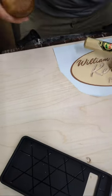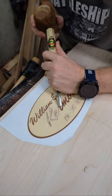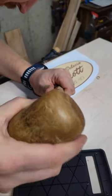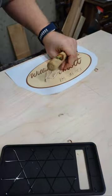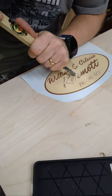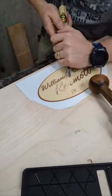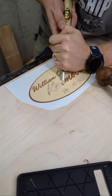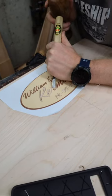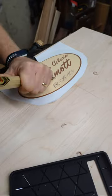We've got a comment saying: I tried my first wood carving at a bench last night, it turned out terrible but I had a nice time. Perfection rarely comes on the first try — carving's not easy if you're not used to it. Next question: the solution for tear-out when going across the grain is sharpness? Yes. Sharp. And using the impact allows me to punch through it rather than giving it time to bend and flex out of the way. I could do all of this freehand without any impact, but I find I get a little more control with the mallet.